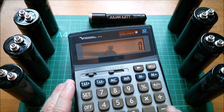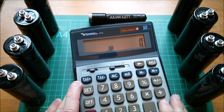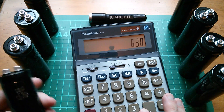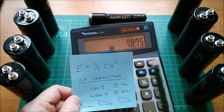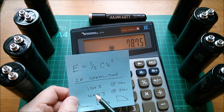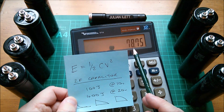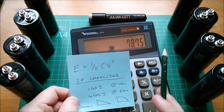Let's calculate how long these capacitors will run a 100-watt LED. These are 630 farads divided by eight because we're putting eight in series, giving about 80 farads. Going from 20 volts to 10 volts on the 2-farad example we extracted 300 joules — that's 3 seconds at 100 watts. This bank is about 40 times bigger, so 40 times 3 is 120 seconds — about two minutes.